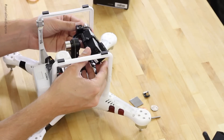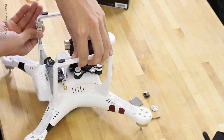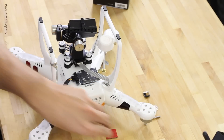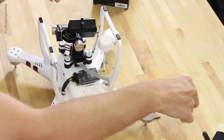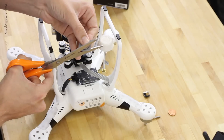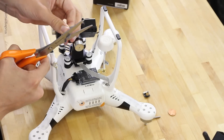As you can see, it's actually very well balanced. Some people do have an issue with the balance, and you don't want it to be unbalanced because it's going to burn up your motors as they try to keep the camera stable. What you can do to fix that — we haven't done it here because in our case this specific copter with the gimbal and camera is quite balanced — is take some outdoor mounting tape, which is double-sided. Depending on the weight difference, most people will prefer a penny, but if you have thick mounting tape like this you'll only need a dime. Stick that on there and quickly cut around the edge to get a nice clean line around the coin.